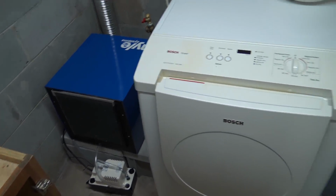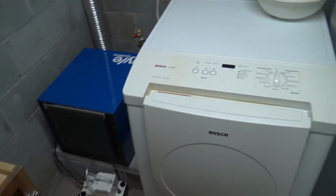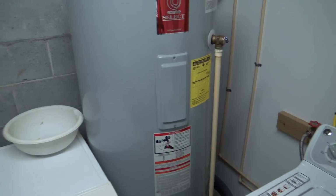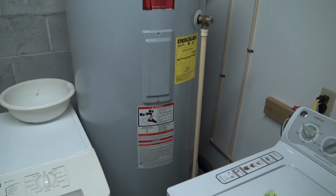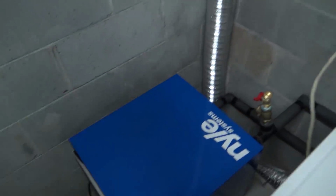Should do the trick. Also adjusted the well pump. Needed a little bit more pressure, so I adjusted the pressure switch up. And so their water system is good to go. And we did a generator test, and so the Magnum hooked up to the generator, started charging the batteries instantly, so we're good. Just a follow-up. Sometimes you just got to come back and make sure the customer's happy with some small subtle adjustments. It's also good to go back and just make sure everything you did is working as you thought it would.